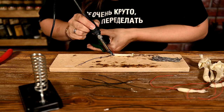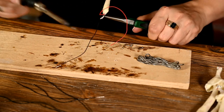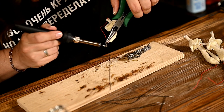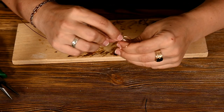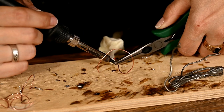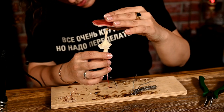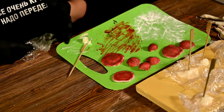I still need to finish the electrical part. I'm soldering black wire to the stiff wire stem to complete the circuit — I used red and black wire just to tell the plus from the minus and connect everything correctly. I wish I had used white wire for the stems as the red one is too visible through the silicone. I also need to make supports for the caps — I'm making a kind of spiral outer wire that fits the mushroom cap nicely and soldering the supports to the top edge of the resistor. For bigger mushrooms, it would be better to make the stem and support from one piece of wire and just solder the LEDs and resistors onto them. I'm also making the cap undersides the same way I made the skirts earlier.